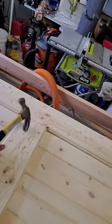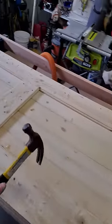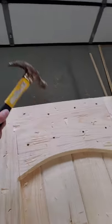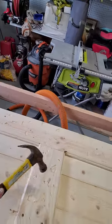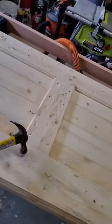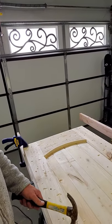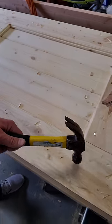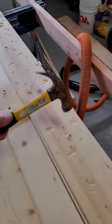Then I went back with both sides of the hammer. I used the claw side to put marks all over, then I used the face side very randomly. Try not to follow any pattern — keep it very random. Make sure you work all the way around each edge. Some people tend to work up the middle — you want to avoid that. Get all the way to the edges to make it look like this log has been used and abused over time.